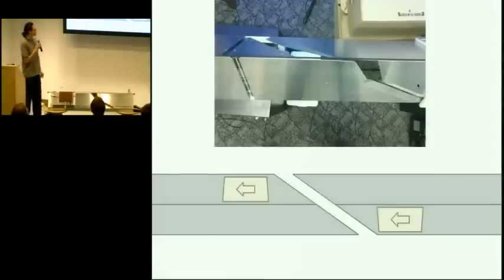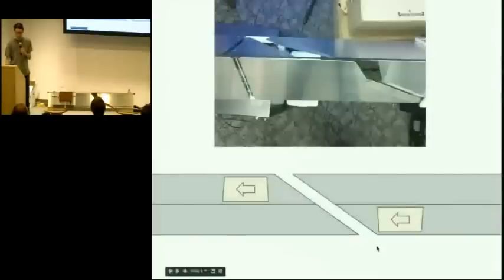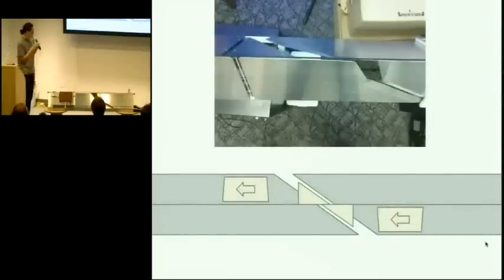So for example, if you have this prism shape, and I'm looking at a top view here, where a page on one side has to get from that side over to the other side. The simplest thing to do is to cut a slot, like a diagonal slot in that prism, so that the page can slide into it and go across to the other side. The problem you run into is when the page is in the middle of that slot, it actually has to kind of twist. The binding of the book stays straight, but the page has to twist along that slot, and that's something that it just can't do.